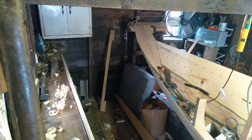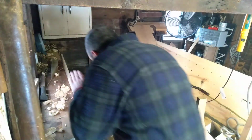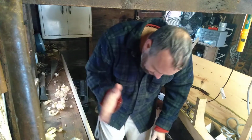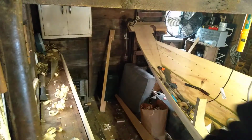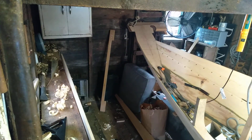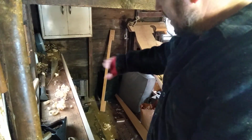Sight down along this as well. Like I said, you definitely don't want any round down in the plank, because when the plank tumbles home, if there's any bend inward to it, in the shape of the dory tumbling home, the plank will actually drop. So it looks good. It's pretty much straight there, a little bit of a kick to it, and there's not a lot of bend where it tumbles home in the transom of this boat, but some boats that have tumble home, those planks will dive quite a bit if there's shape to the bend to the plank back there.